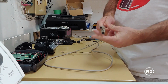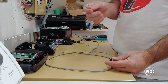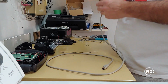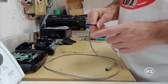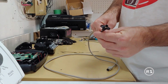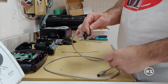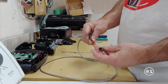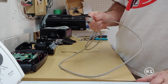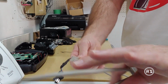So as I said, I don't know if the cable is crossover or what, but what I did is I cut the end that's plugged into the wheelbase, and I welded the connector of my other 300 RS wheel. And I tested last night and it worked perfectly. Now I push every button and the screen reacts as it's supposed to. So this problem is fixed. I don't know if it was a bad cable or a crossover or something, but now it works great. So this step is done.